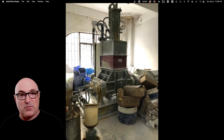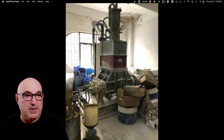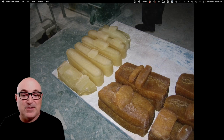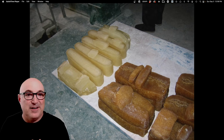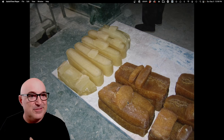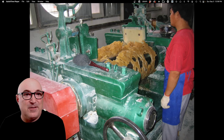First things first, you've got to make the rubber components. The uppers are being made on one side of the factory, and the rubber componentry is being made on another. First, there's a big mixing press where they mix together the raw materials. This is what natural rubber looks like — this brown stuff. And this could be synthetic gum rubber; you can tell by the clarity of it.